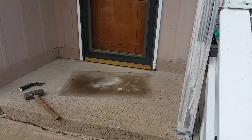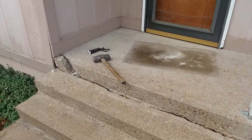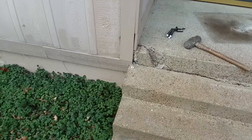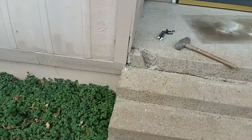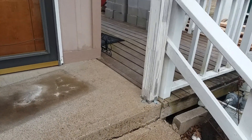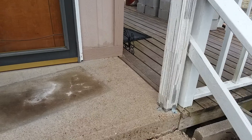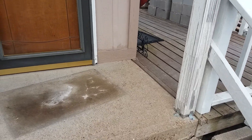So today we're going to knock out these steps, take out the slab, and see what it's going to take to form up another foundation — because I imagine it's just limestone and dirt underneath it. We're going to tie into that existing block and remove some of these porch railing boards so we can figure out how we're going to tie in the blocks there.